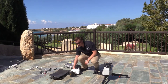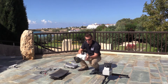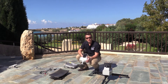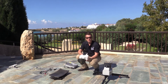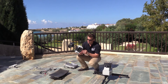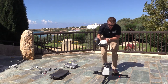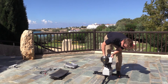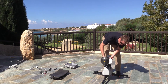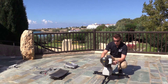We're now ready to place the transceiver unit on top of the GX10. This transceiver from Skyware Technology is a five watt transceiver, built especially for GX, supporting Inmarsat's one touch commissioning system for super easy commissioning. On the underside of the transceiver unit you'll notice there are a couple of slots. We position the transceiver unit over the top of the GX10 and then it simply slips forward to the point where we can tighten up the wing nuts on the side.